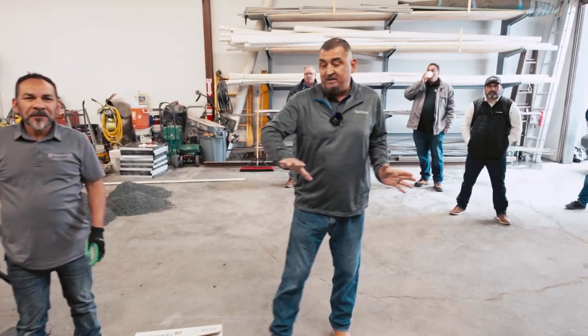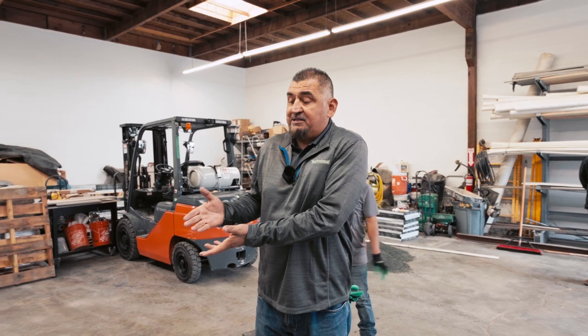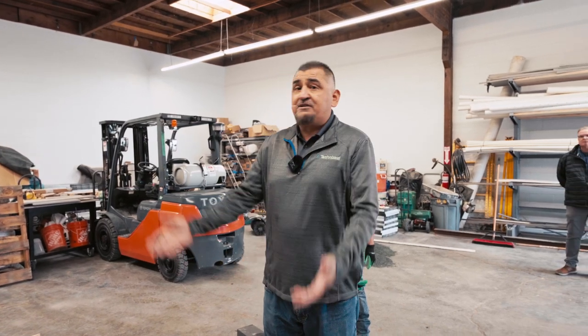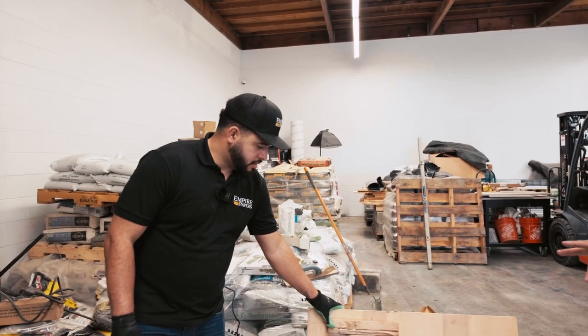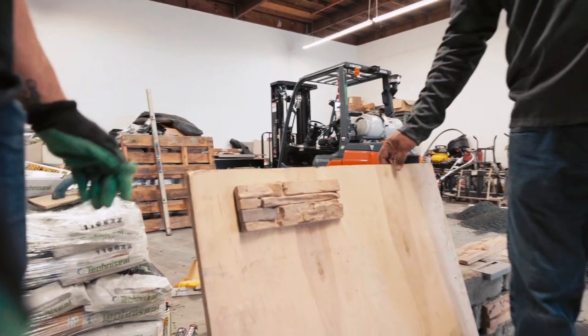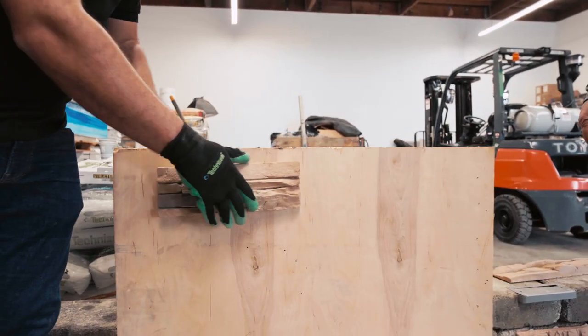Showing you the power it has. Imagine starting from the bottom — you lay your first course and then stack as much as you want on top. If the first course is suspended in air, let it sit about 15 minutes. If it's supported from the ground, which most veneer stone is, you can go as fast as you want. Full cure is within a day, but try tugging on it — you can almost lift up the whole plywood. It's already set. Once it's set, it's done.